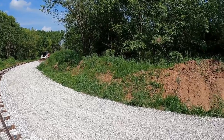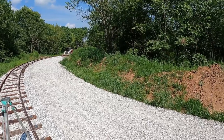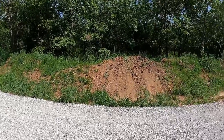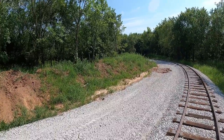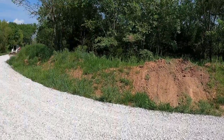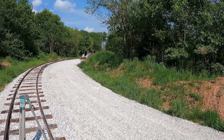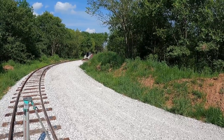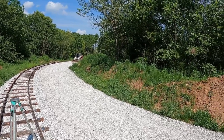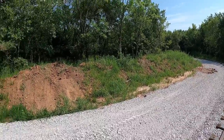So you can do this with the loaders. It's a real good way to normally knock a track off there if they're not tensioned right. All you got to do is listen to the tracks and listen to the machine, and you can tell it'll bind up a little bit and start clanging. So if you just back up some, that's what I did yesterday on that other side. I popped it off the front idler, and I was able to back up, and it jumped back on there. So we'll jump in there and see if we can't turn these into something.